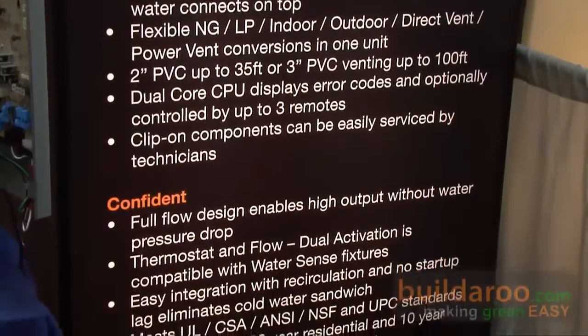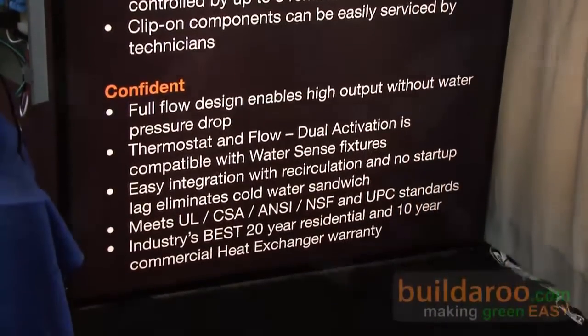And how does this compare in price? We're a little bit more expensive than a standard tankless, but we're much easier to install. We thought about removing all the infrastructural challenges that come with tankless — you've got to do venting, gas, and redo plumbing. That's not the case with us. We use schedule 40 standard two or three inch PVC for venting, and our plumbing connections are right on top of the unit, so you don't have to reconfigure your plumbing pipes. It's much more cost efficient and much faster to install one of our units.